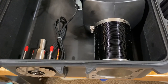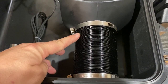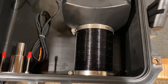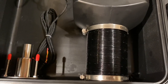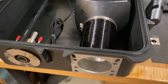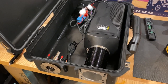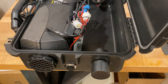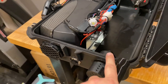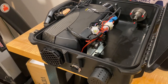I determined that I will need five inches of this heater hose — you may be different depending on how much you want to collapse this down. I did give myself an extra inch of pulling this back and clamping it so it's nice and flush up on the heater. When you put your clamps in, I like all my clamp settings to be on the same side where they're easy to adjust. I'm going to put the bolts in and bolt that to the front with the piece on the outside so I can run the heater hose to my tent. I just cut a piece of the six and five-eighths tube that comes in the kit — that's going to go for the air intake. I'll route this corner to that corner and use the supplied clamps, but I'm going to get some better clamps for the exhaust side.